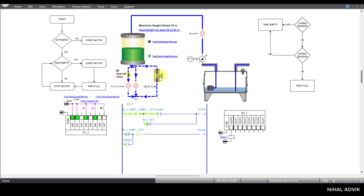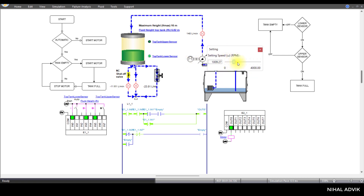If you want to increase the speed of fluid draining from this tank, you can turn on this one, and there is also one more throttle — you can open this valve too. For manual mode, if you turn it off, the motor is going to turn on again. The level of the liquid in the sump is also decreasing. I'm going to increase the speed of this pump. I'm going to switch to automatic.